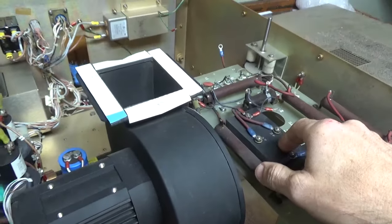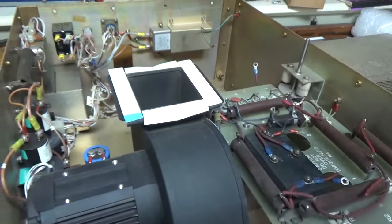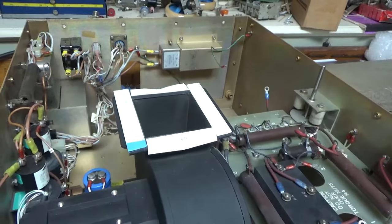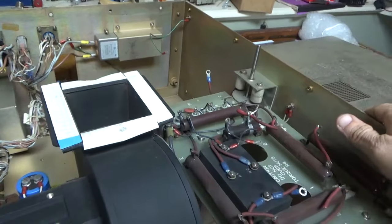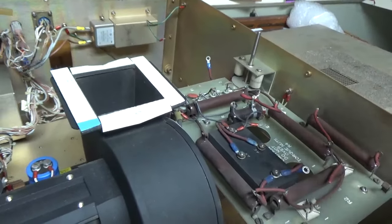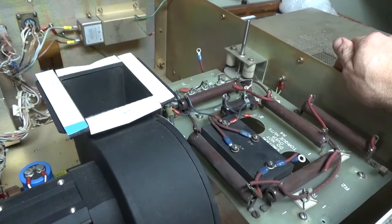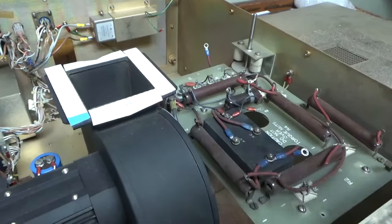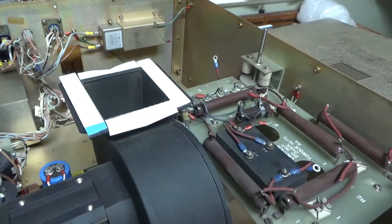I have the 4CX15000 amp here that's multi-band. He wanted me to add that this amplifier is capable of 12 kilowatts. If you went to a 10,000 tube that's capable of 28 kilowatts or whatever the rating is, first off, it's stupid. You can't use that for ham. It's not a good idea. And it's only half an S unit, roughly half an S unit.